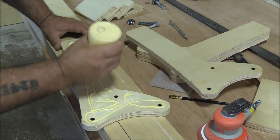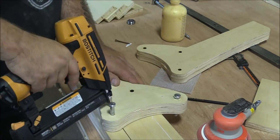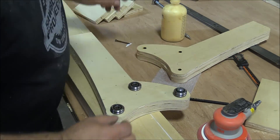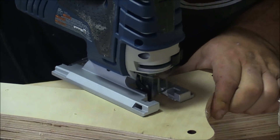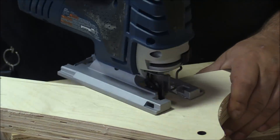While those are drying and getting sanded, I'm going to put together the gantry towers — the part that slides up and down the sliders that holds the gantry. The concept is really simple: I'm using some V-groove bearings that are bolted to the gantry tower and a 1/8-inch steel rod rides between them. I need to be able to adjust the tension on the top bearing, so to do that I'm elongating the hole that it rides in.